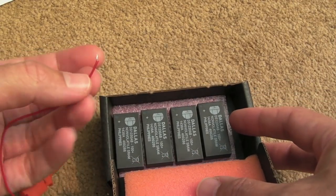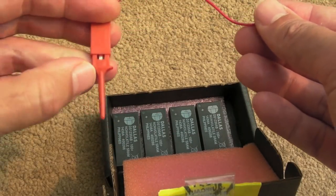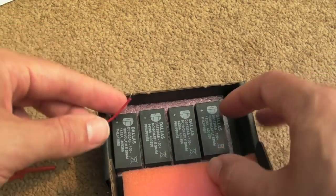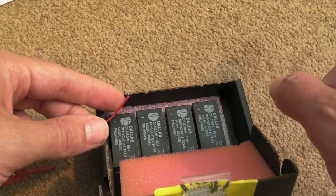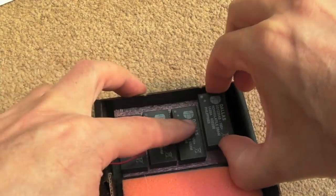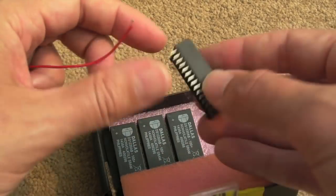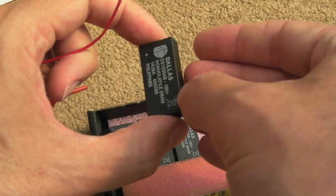What we need to do is connect a couple of wires up with clips to a couple of different ICs on the board. One of them is the latch — I think it's IC74 or IC76 — and the write enable pin needs to go to pin 1 on IC14, I think. I'll probably need to bend the pin out and solder wire onto it, making sure it doesn't make a connection with the socket. We'll have a go.